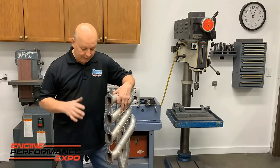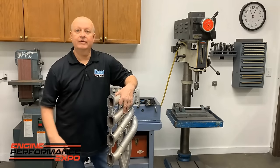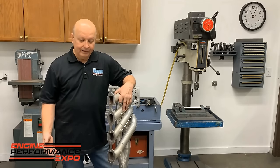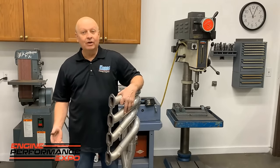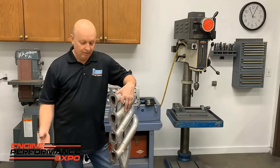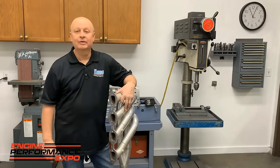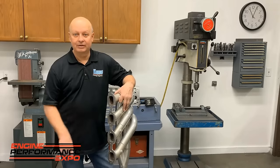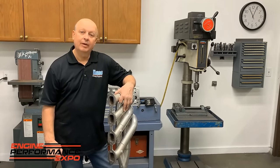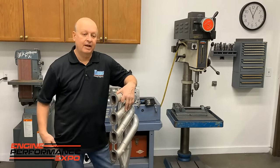So what that does is it's going up and down with the rings and everything, and it scratches the bores up. You guys wonder, well, why? I cleaned this engine really good. Why are the bores scratched up when I took it apart? Well, a good bit of it is what happens when you're first cranking them with a mild steel header. So there's one way you can maybe make things a little better if the headers have been on it and it sat for 2 weeks.